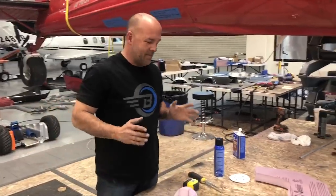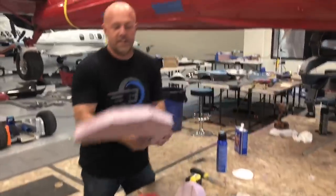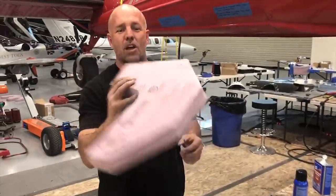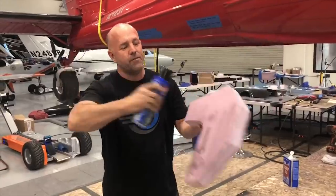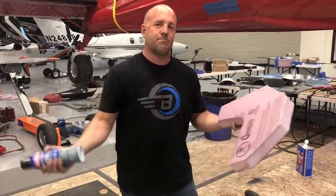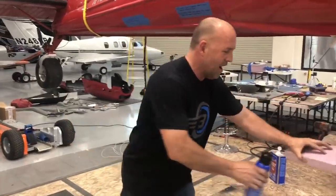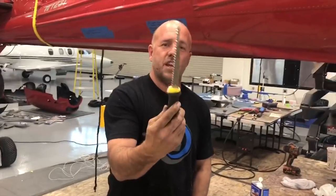What I'm doing here is making another mold. I've made several out of wood — if I'm pulling several parts out of it, I've got to do that out of wood and bondo. But I'm just making one part, and I know I'm only making one. This is by far the easiest way. Pick this up at Lowe's or Home Depot — a can of spray adhesive. Spray it, wait 15-20 seconds, stick another piece on, spray it, stick another piece on. I literally just slapped a few pieces together, then took this sheet rock saw.